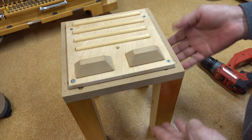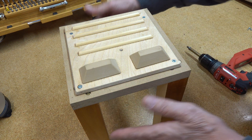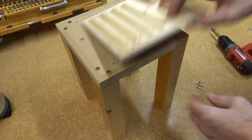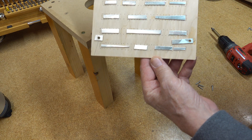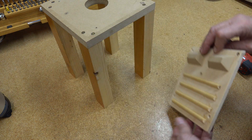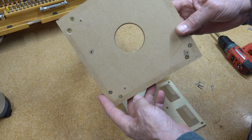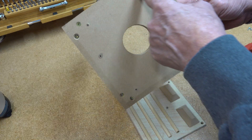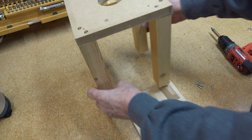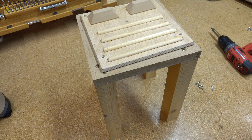What this is all about is just four legs getting it in the air high enough so that you can take your frame of plastic and stretch it around it. It's a lot of spacers. All you have is one hole, and that fits your shop vac perfectly. None of these holes are allowed to go through the board - you need to have everything sealed up and closed off on the back side. It is that simple - you're just hooking up a vacuum source to it.